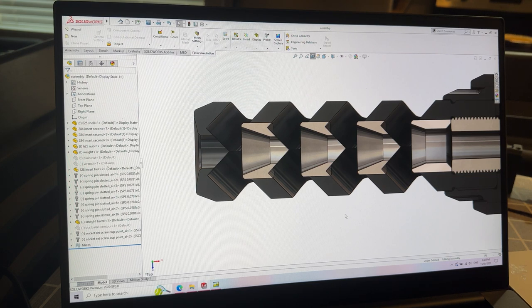We also have a byproduct from that: because of how much emphasis we place on the nozzles, this geometry extends forward, which means the gas is not able to escape out the side of the brake as easily without touching a surface and being converted into fighting recoil. Whereas if we didn't have this geometry extended so far forward, the opening for gas to escape sideways without being used to fight recoil would be far greater, making it a much less efficient design.